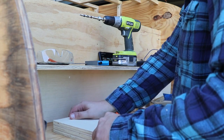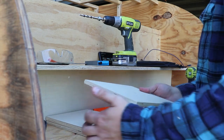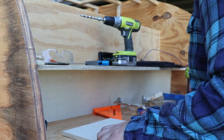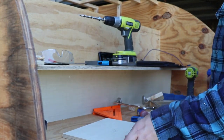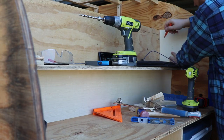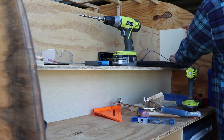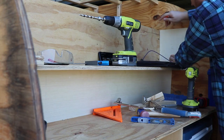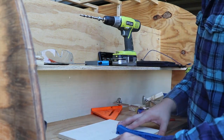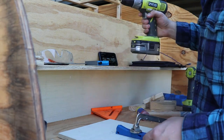Once the dividers were cut, I was able to go ahead and get them prepped for mounting. I'm again using pocket holes here, essentially just making sure that I have pocket holes going into the bottom as well as into the back, which is all I'm marking out here. I like bottom and back — that just gives nice, sturdy wall supports for the cabinet. I'll go ahead and speed this up to 500 times, which I'll be honest, makes me look kind of funny.